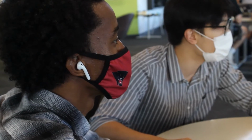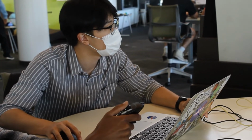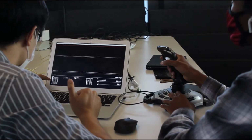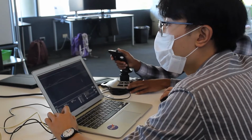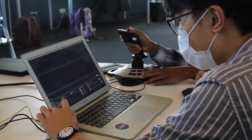I was interested in RC planes before the project, and now I'm incorporating what I learned from other hobbies into the project. I have used a Pixhawk with some compatible sensors such as accelerometer, GPS, gyroscopes, barometer, etc. And those are general setups for RC planes, incorporating some motors and propellers. But to be specific, designed for our project, we have done power calculation and battery calculation just to make sure that we have enough endurance and enough power.